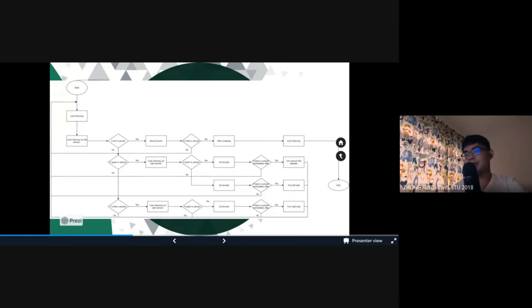Then we check what the robot should be doing using an if-else loop. If red is sensed, it signals that we are at the entry of the collection venue and hence it will move forward — unless it happens to be at the other side of the collection venue and moving towards the entry. After that, we check that when it moves forward, it will detect only white and not black. If only white exists, it confirms that we are inside the venue and will commence sweeping. If else, turn backwards. If the colour sensor is green, the right sensor will be triggered and start sensing for the presence of a green grid on the right side to determine what the robot should be doing. In the event that two grids are sensed, the robot will move forward and check for the presence of a black line. This is to prevent the event that the green grids are actually on the other side of the black line and the robot is not supposed to care about the green grids.